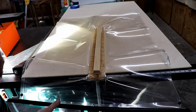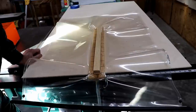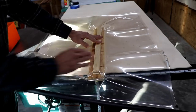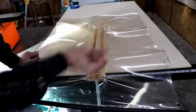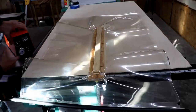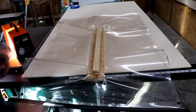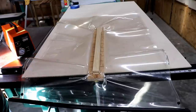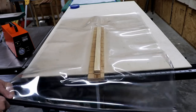Wow, that worked wonderful! That's better than anything I've ever done before when it comes to gluing up laminates. It is just wonderful to be able to clamp something like that up that easily — 12 pieces of laminate, just like that. You can see the pump has kicked off already and it's holding pressure. You can just tell it's stuck together. That's going to come out perfectly flat — you couldn't do it any better. It's been 24 hours; we're going to take it out of here and see what it turned out like.